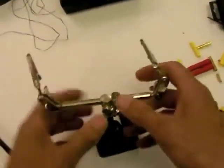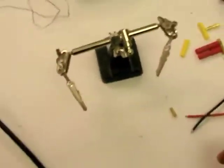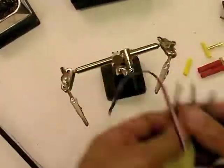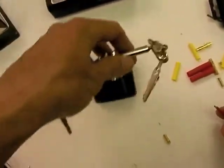I like having helping hands — it's an extremely useful thing to have around. The other thing that's going to be useful is a high-quality soldering iron. This is what happens to my solder — never let kids around your spool of solder. I've been trying to use up all the stuff they pulled off. So this solder — these have already been tinned, and I'm just going to go with the tinning they've got. If you're paranoid, you can strip them and re-tin them, but I think it'll work well enough. Just make sure that iron's good and hot.